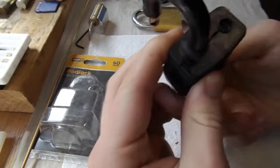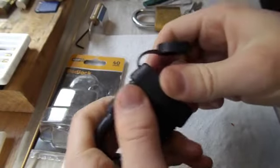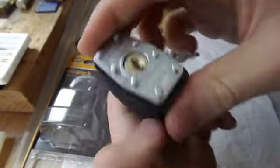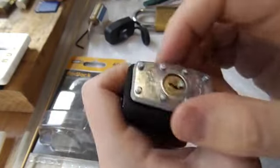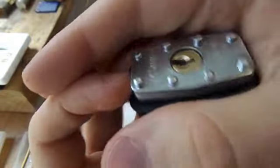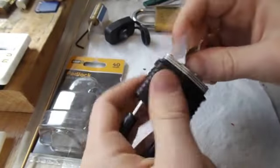Double locking — that's a giveaway — which is good. Brass locking lugs. And we can see down in the shackle hole it's actually laminated — it is a laminated body as I expected. That's quite an easy way to build locks. Generally with some of these weatherproof locks you can normally pop the bottom rubber cover off and get much better access to the core, because we've got this huge piece of rubber which stops us from getting in and tensioning the core. We've got some writing on here: 40mm, made in China. And the rivets on this don't look very well pressed down, so after we have a go at picking this, we might try and get a screwdriver in there.